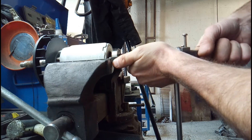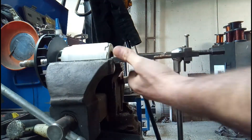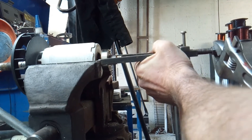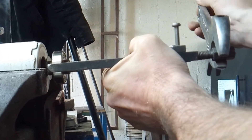Now it's important to mention that there is a very fine thread in the shaft on this non-drive-end. If you're using pullers with a very sharp point, just don't damage the thread as the centrifugal switch won't go on again and you'll have to re-tap it.